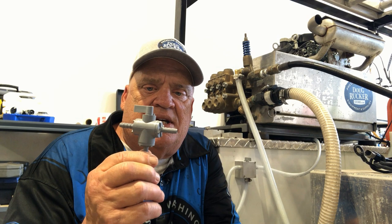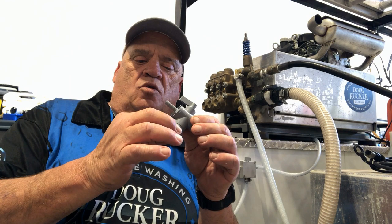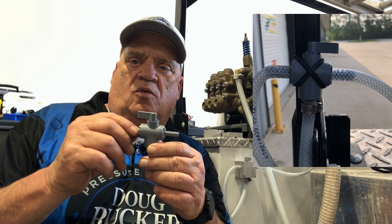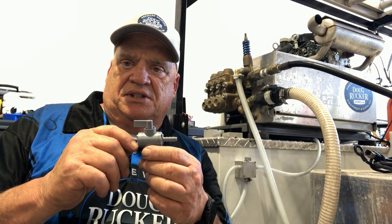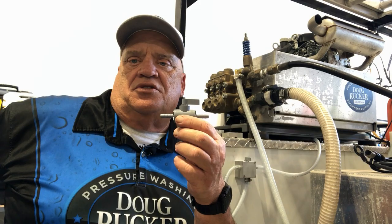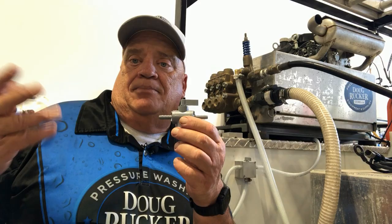Something I've been using for many years is called a poly three-way valve. These are on our website — you can buy these by themselves if you'd like. You have one quarter inch hose that goes from the bottom barb out to your injector, then another hose that goes to your water tank or water bucket, and then another one that goes to your bleach. When you want to rinse, you simply turn this valve to the water side and it will draw water only through the injector, or you could switch it to the other side and it's going to draw bleach only through the injector. That was the way we used for years to go from bleach to water when downstreaming.